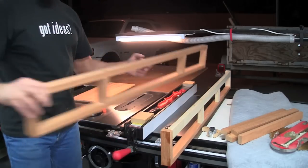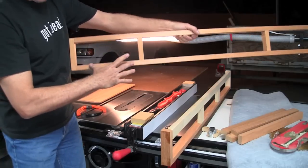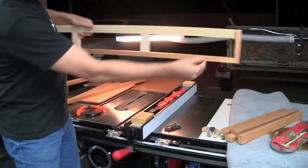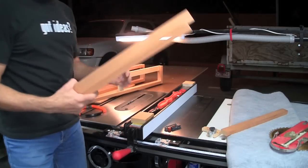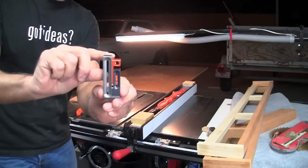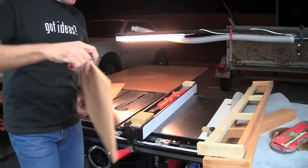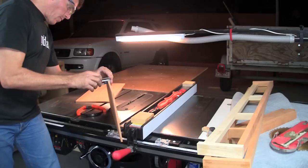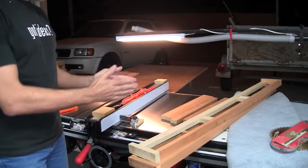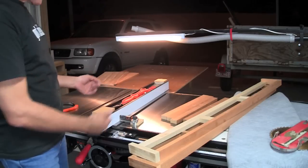This is part of the top of the tee and this would be the inside surface. I'm going to put a dado or groove all the way across this so that I can put the panel in here and in here. I'm not going to worry about having put a groove there for nothing — it's fine. There'll be one here at the back portion, and one along the bottom to receive it in the back. I'm going to use the KM1 from Bridge City Tool Works. It's already calibrated to this dado — marking a quarter-inch dado. We're going to use this to set a groove exactly the thickness of this board. Just put the kerf maker on the board, squeeze it, and lock it down. Now it's set. I have the KM1 in position and set up to do the first cut at the distance I want from the bottom of the vanity. It'll tell me how much to nudge over the fence to make a perfectly sized dado.